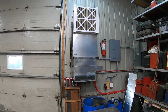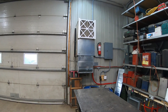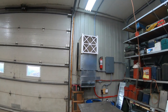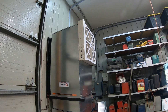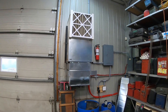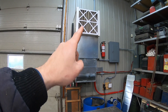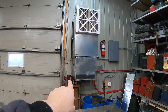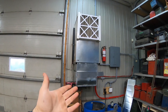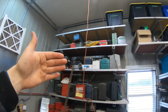I flipped it upside down, which is allowed by the manufacturer. I fit a four-inch thick filter because the airflow and the amount of dust we get in the garage is significant. The reason for the output being at the bottom is because there's no point putting heat at the ceiling if it then has to travel all the way back down.